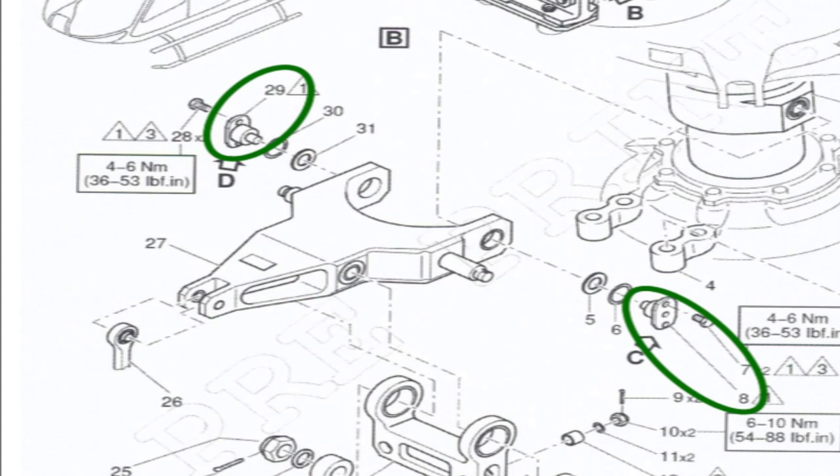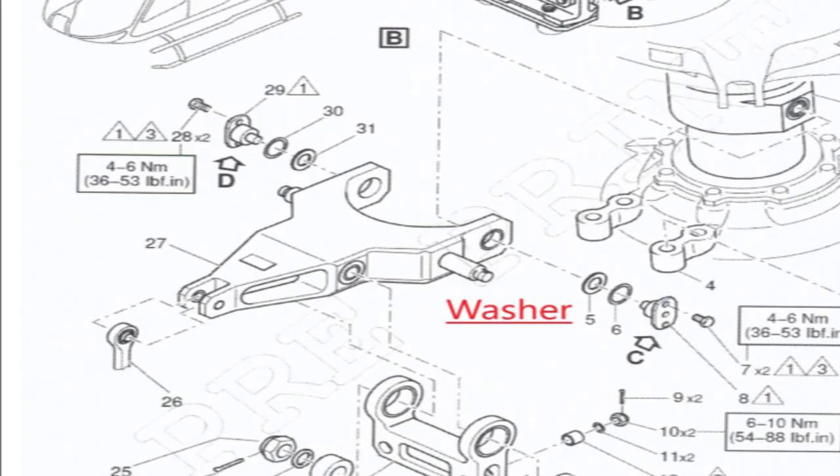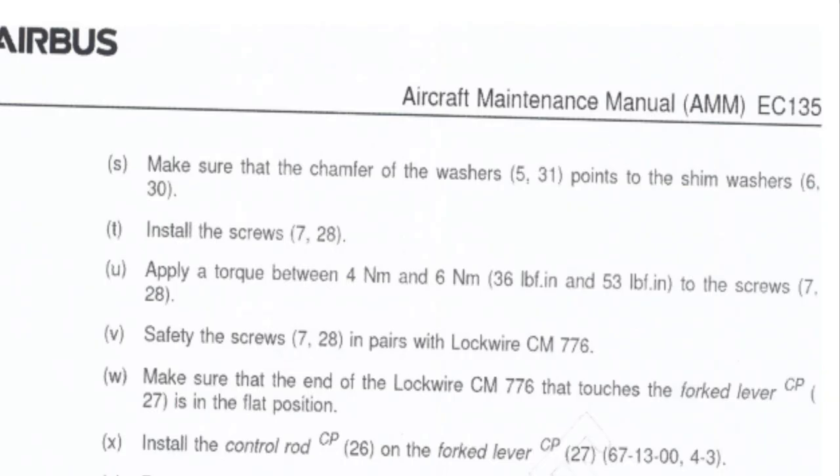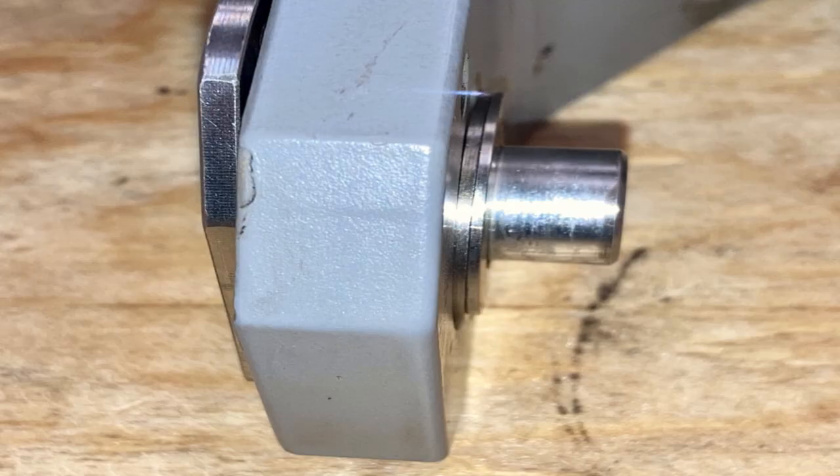There's an important caution here. It says: risk of damage to the shim washers 6 and 30 — if you install the washers incorrectly you will increase the wear of the shim washers. Make sure that the chamfer on the washer points towards the shim washer. Number 5 is the washer and number 6 is the shim washer. Then continuing: make sure the chamfer of the washer points to the shim washers, and then install the screw.